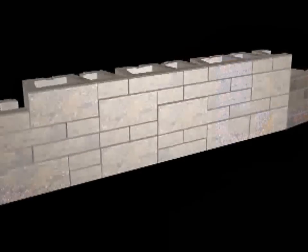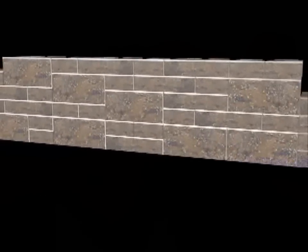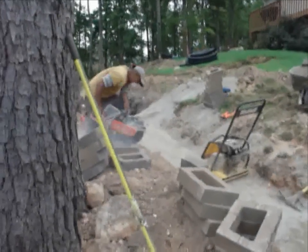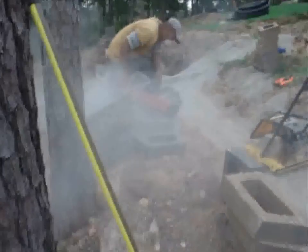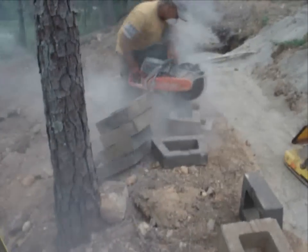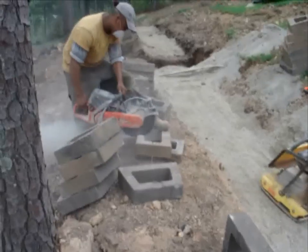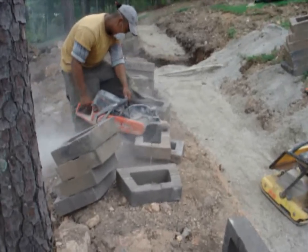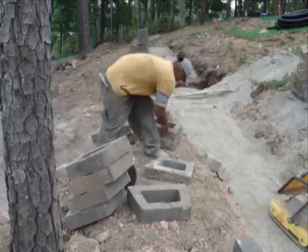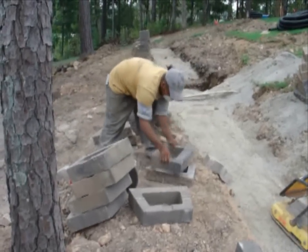Typically, the random multiple piece pattern requires approximately double the square footage of 4-inch Geostone landscape block as it does the 8-inch standard. What makes this pattern possible is the placement of half blocks at different intervals throughout the wall. These half blocks are a field modification made by cutting the 4-inch landscape blocks in half from face to tail. Measure and mark the blocks before making cuts to ensure symmetry. Cutting multiple blocks and setting the halves off to the side will save time.